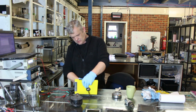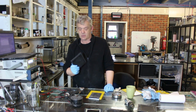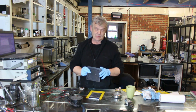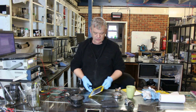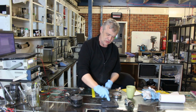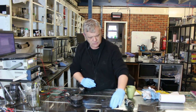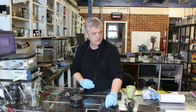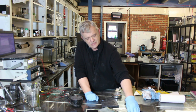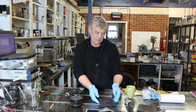If I take that to pieces — there is the supercapacitor itself. That weighs 200 grams. It's 18 volts, about a thousand farads. And these are the end plates. That big bit of metal slaps on that end plate there — that is the connection. It's made up of a whole series of individual cells. Each individual cell is two of those plates, a bit of carbon, an electrolyte separator, another bit of carbon, another plate. And then we just build those up to make our supercapacitor.